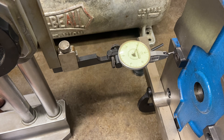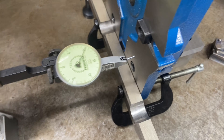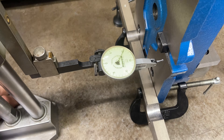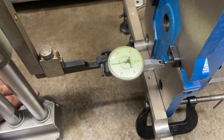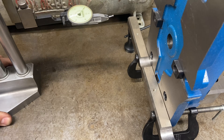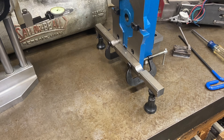The locator tabs for the t-slot are now the same. I picked the high spot on the needle and if I go over here I've got it exactly the same — within half of a thousandth. A human hair is like two thousandths, so I'm going to call that pretty good.